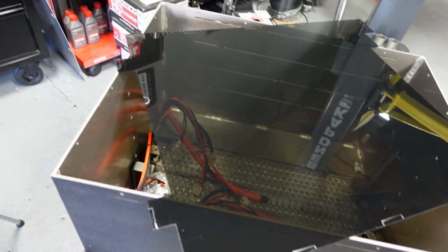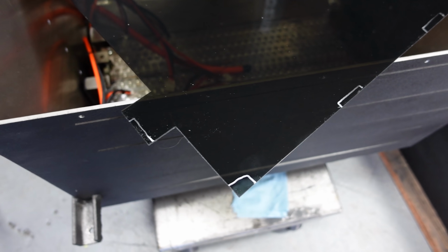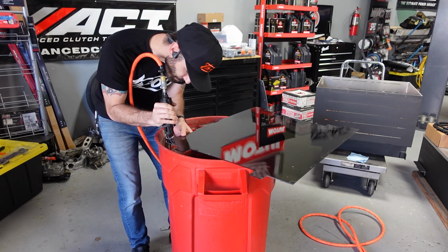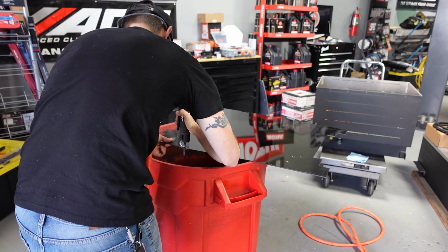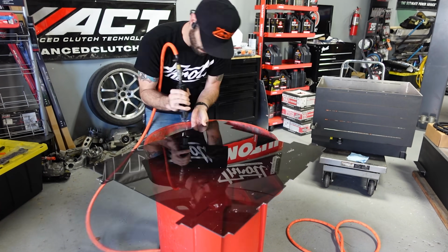All right, so I'm laying this acrylic layer in between the 2 bottom batteries and the 10 stack above that. And there's no way for me to really know where the welds are until I lay it in there, and I've kind of marked around where I need to notch out so that this thing will sit flat on the bottom surfaces of the box. So I'm gonna go ahead and get on the bandsaw and some hand tools and just kind of etch out all of those little notches so that this guy sits perfectly flat. And then we'll go ahead and lay this in, and it's time to start loading in those upper batteries.